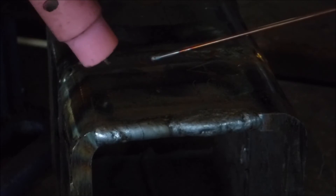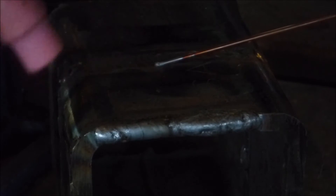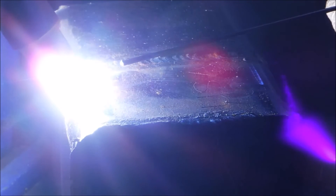The first starting method is the Scratch Start — you just scratch the tungsten across the workpiece, like you see me doing a dry run here. Sometimes your tungsten will stick, and that can be normal. It's the simplest method and you can use it in any joint configuration. You do it kind of like striking a match — that's how I've heard it referred to, and that's how I'd refer to it. The second starting method is the Lift Start: you rest the cup on the workpiece and rock it forward until the tungsten touches the workpiece. It's pretty simple. Sometimes the tungsten will stick, but a sharp flick backwards will usually break it off.